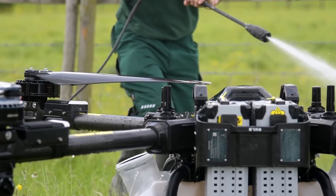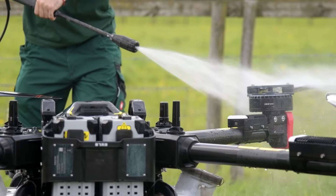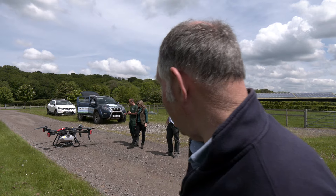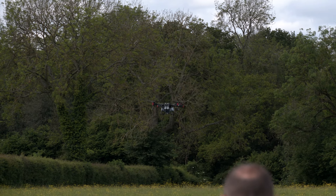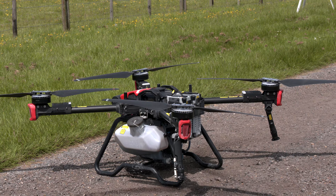This was never a test of the drone or the fertiliser, but whether they were compatible. We set it up to deliver the right amount — 5 litres per hectare — to cover the patch, and it's done it. The tank's empty, it's come back and landed. Wonderful. After a successful first flight, it looks like the future of farming could be sourced from the sea and delivered by air.